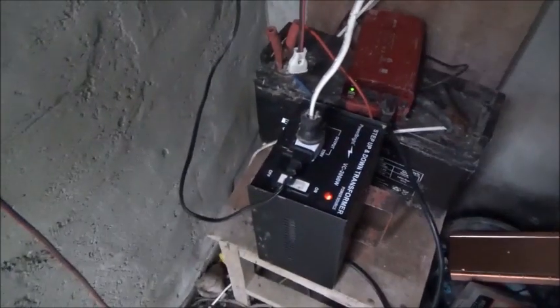Trying to get some aeration going here too just for a few minutes. This will probably be the last outside video I'm going to make. So here's what I did — you've seen the Filipino MacGyver in action, now you get to see the Okie MacGyver in action. We have this 12-volt inverter hooked to this transformer which will transform 110 to 220. This line is going into the house so we have Wi-Fi and lights and we can keep our gadgets charged, running off that battery.